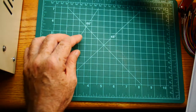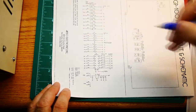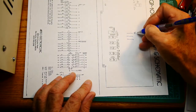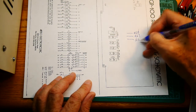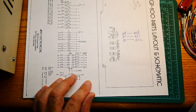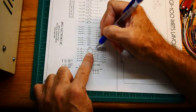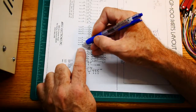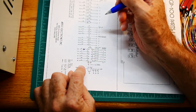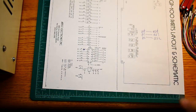The way that we're going to connect those is we're going to have three connectors to register select 0, register select 1, and register select 2, and we're going to connect those to A0, A1, and A2. Unfortunately, A2 is already being used — it's part of this address select. Bit 0 and bit 1 are not used, but bit 2 is used. So we're going to have to cut this and not use it. We will use bits A0, A1, and A2 for the three registers.